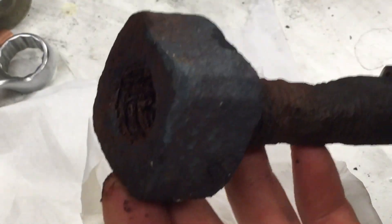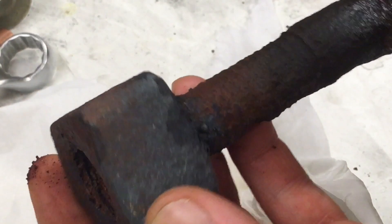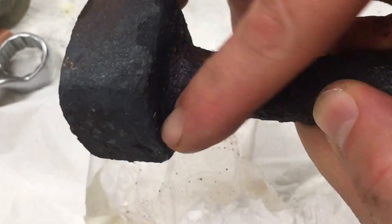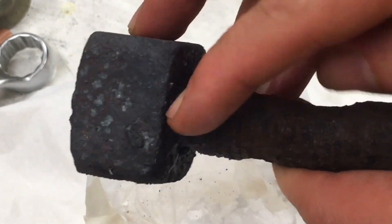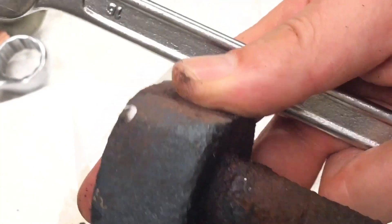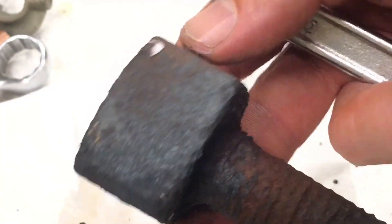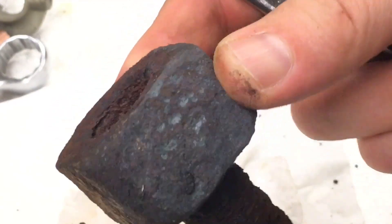Now I'm just going to take it up, wipe it off and take a look at it. You see there's still a lot of rust inside. But everything is literally falling off — all in here — just by poking a little bit. Well, this is definitely not a just-unscrew story. Although a lot of rust falls off when you heat and cool it rapidly, you can see the metal is clean on the outside. But you probably have to do this a couple of times and this bolt is still stuck.